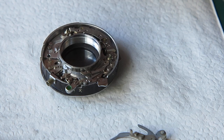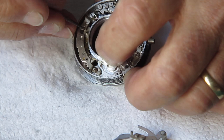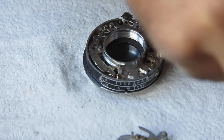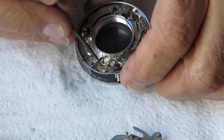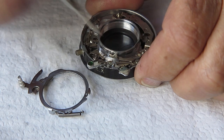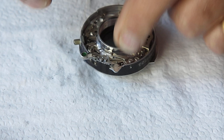Bringing the shutter back into the picture — some molybdenum paste on the lever here that holds back the pallets, some on this lever, on that flat piece, on here and on here. And this can go into position. It's easiest if this is in the cocked position, which it is.